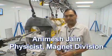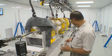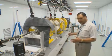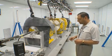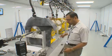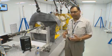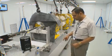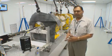So this girder is now back after a truck ride and the goal was to reinstall it the way it was before it left this room. Since this girder, even at its size, is very flexible at the micron level, it is very important to re-establish the profile of this girder the way it was. This is done making use of these fiducials here — the surveyors surveyed these fiducials before the girder left this room to know what these different fiducials look like relative to each other. After it was brought back they again surveyed these to see how they compare with the previous data, and that was used to direct how these bolts should be tightened so that you get the same profile of the girder back, and the girder goes back exactly in the same place as before.